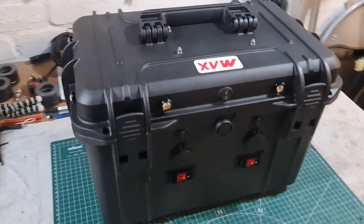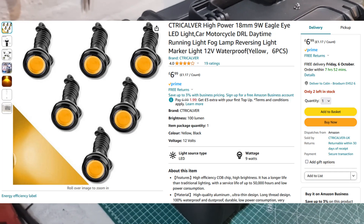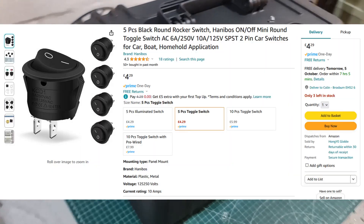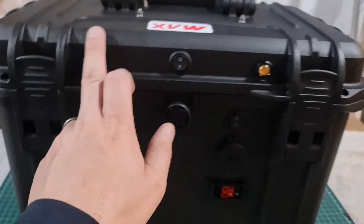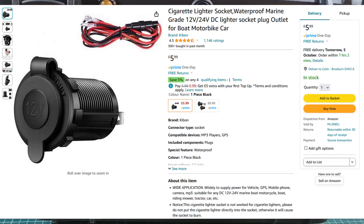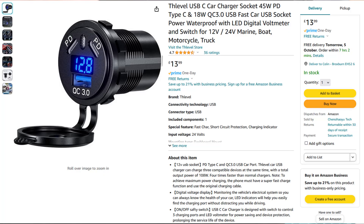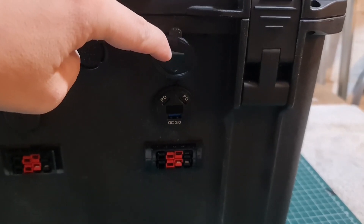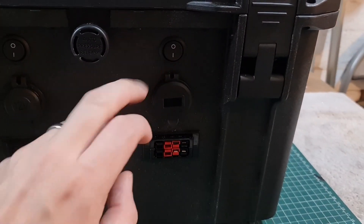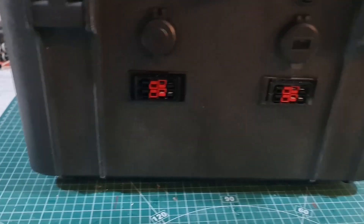If we take a look at the case itself, on the far end you can see we've actually got two LEDs. These are 9 watt LEDs — they're actually yellow. I wanted the white ones but foolishly I ordered the wrong ones, but they're actually really quite good. There's a switch in the middle to switch that. Coming around to the middle, we've got another two LEDs that are switched, two more switches which turn on a cigar or cigarette socket standard — like what you'd get in your car — with a 10 amp fuse. We also have a USB 3 and two USB PD sockets for super fast charging. I've just had my phone connected and I can confirm it's super fast. I wanted the independent switch because if this is noisy at radio frequency, I could switch it off and not use it.